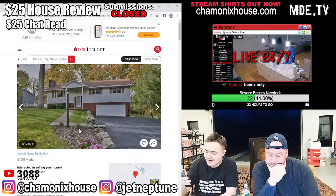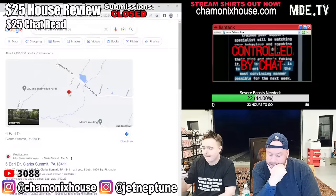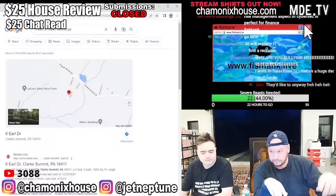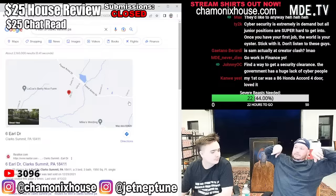Hey, Nick, how hard and costly is it to add windows to a wall without a window? Not that hard. You've got to cut a hole in the wall. You've got to watch out for HVAC. What's behind the wall? You cut the drywall down, you saw the studs, you put a header up, you put some jack studs on the side. Frame it out, put a window in. You're going to have messed up siding on the other side and messed up trim on this side. Just be ready for that.